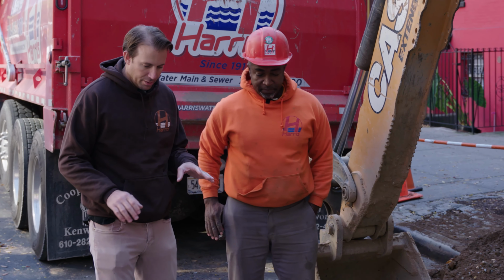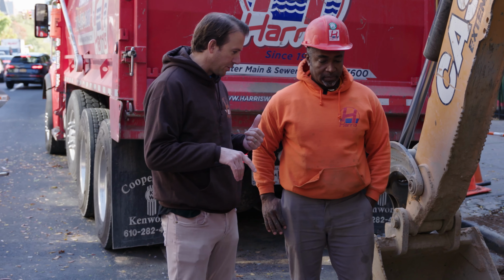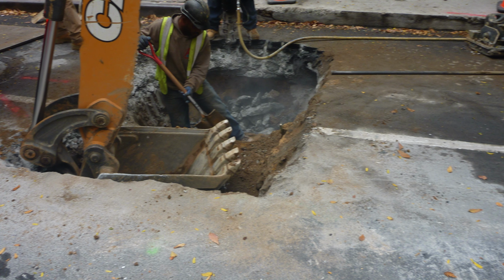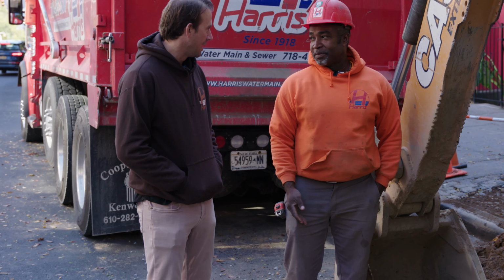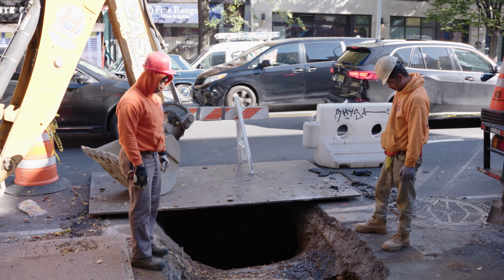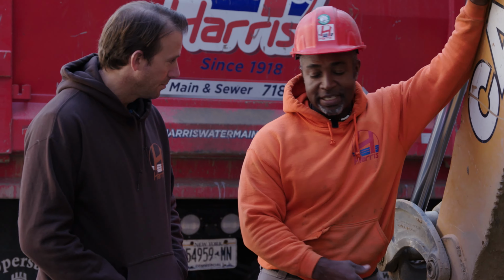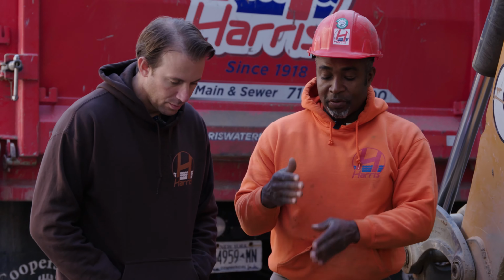So talk to me about what your process was when you started digging for the sewer. I remember the other day when you started breaking the ground, you called me and said, hey, it's nuts over here. So how did we do it? Well, usually before we start a job, we have to call 811 for the mark out. Always. Once they came and marked everything out, I realized this is going to be a challenge. So I took my time, dug out the asphalt and the concrete, and had the guys locate all the utilities by hand. After we located the utilities, I decided I had to move the hole over. I had to cut it back more towards the street in order to get down to the sewer.